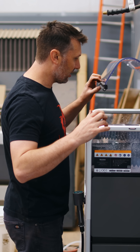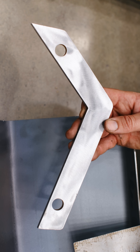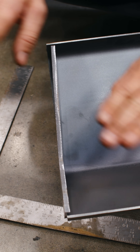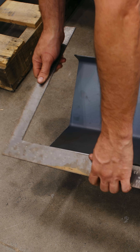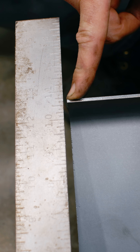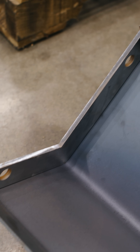Okay, so we've got all our pieces cut and as you can tell we're missing an end cap. This is the next step — we need it welded on the end here so we can bolt everything together. One thing I noticed: the saw wasn't quite cutting perfect, we're off a little bit over here. That's not an issue — we can fix it, but what I don't want to do is weld this crooked. I need it to be square.